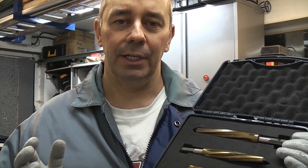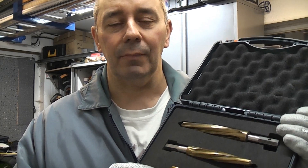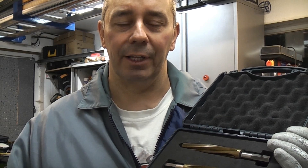If you've ever tried enlarging a hole in steel, especially thick steel, you will know that it is incredibly difficult. You can do it quite easily on a pillar drill, but when you're out in the field and you need to do it in situ it can be incredibly difficult and also dangerous. These reamers actually make that possible and they also make it very easy to do, because you can use an impact wrench to do all the work so there is no kickback at all, unlike when you use a drill.